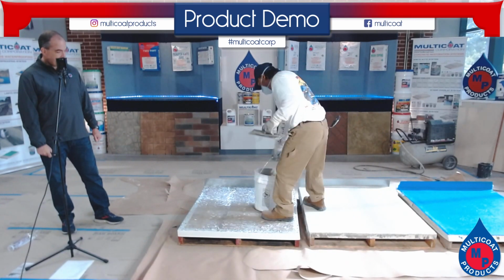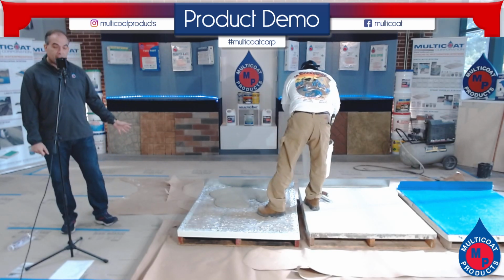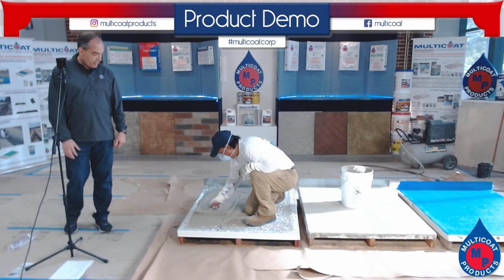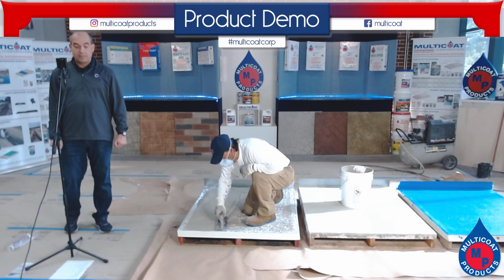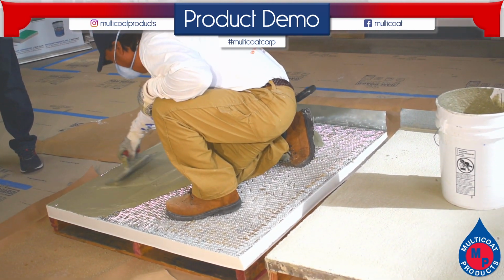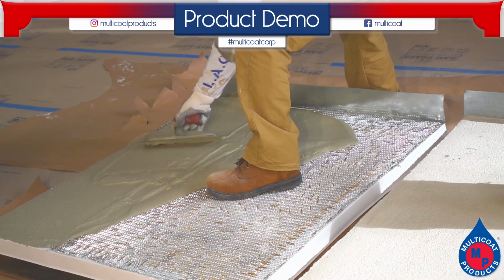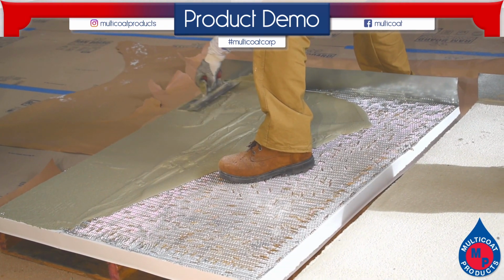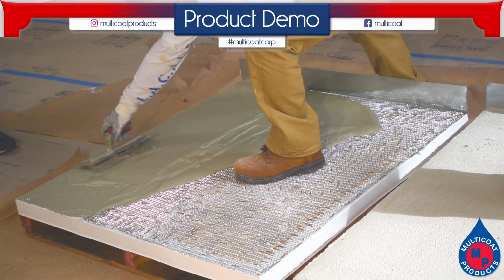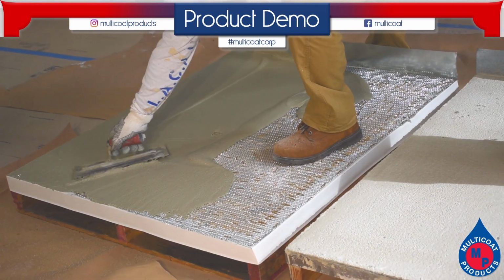So he's got the Multi-Base. We have a lot of contractors that do this around the country. You could use this product a little bit for sloping too if you have an issue with sloping, like you have a drain that was placed in a spot where you need to slope water to there. When you're doing this system, you're able to build up some areas in order to slope. The key is to make sure you fill all the cells with the product and then cover the metal lath. The Multi-Base and the metal lath together help you get your 1 hour fire rating.